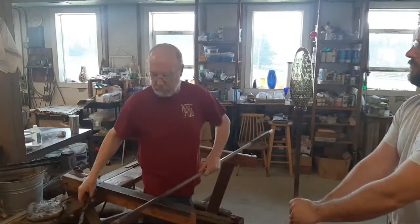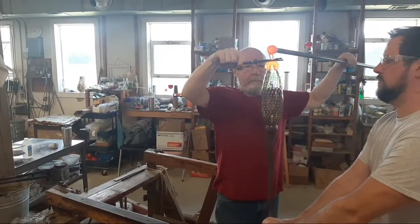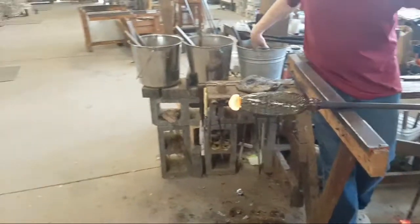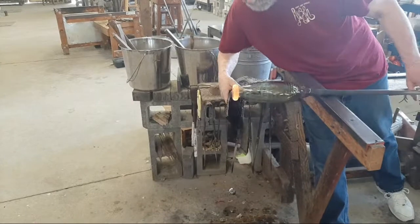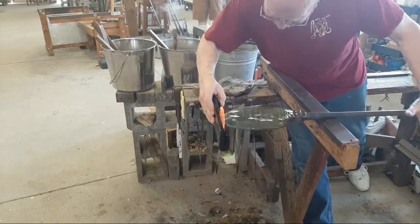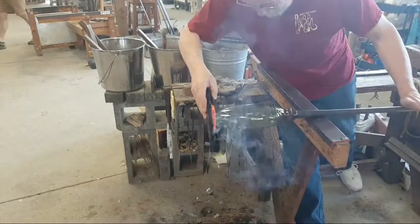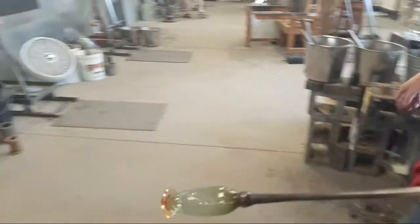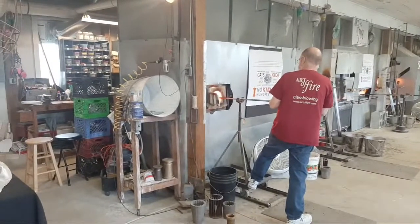Josh turns the piece upright so that Foster can drop the foot on the bottom of the vessel. He'll turn the piece right on top and snip it off. Josh will keep it turning so it stays on center. Foster will grab what's known as a footboard — a pair of boards, pieces of wood, where one side has notches cut in it — and he'll squeeze real hard to thin out that dollop of glass, giving him a really nice knife edge and a sharp-looking foot.